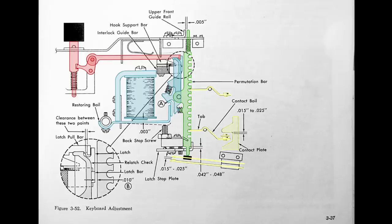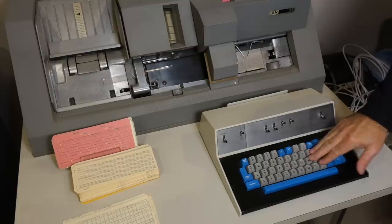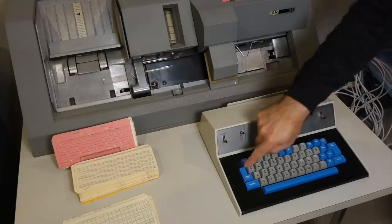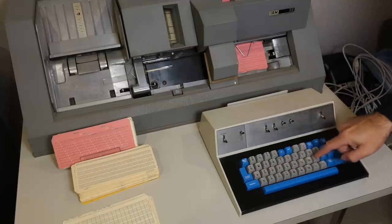There is yet another mechanism in purple — that's the interlock mechanism. This mechanism prevents you from pressing another key while one key is latched. So a single latched key will lock the entire keyboard until it is restored. Which is probably what fooled our strong-fingered visitor. When you first try the keyboard on an unpowered machine, the first key will go down normally and latch down with a delicious mechanical click. Then you are tempted to try another key, but the purple mechanism has interlocked all other keys, and since there is no power, the key that's down will never be restored. So all the keyboard is locked — frustration and key breakage might ensue.